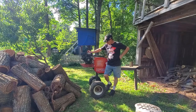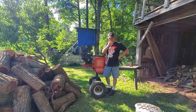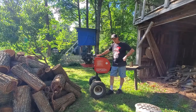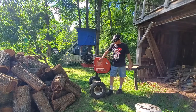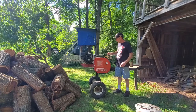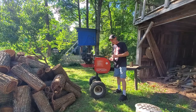This is a SUPERSPLIT wood splitter. I've had this thing for years, I think since 2008. This operates on a rack and pinion system. You can look at that online if you want, but it's got two 100-pound flywheels. I believe they're 100 pounds. On a common shaft that's machined out like a gear. In the center, the axle is machined as though it were a spline.